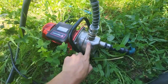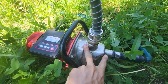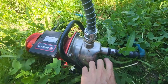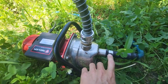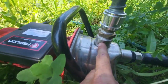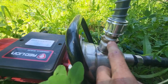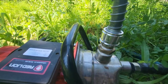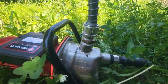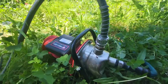This pump comes with both ends as female one-inch standard threads. It does come with a plastic piece that goes from one inch to garden hose thread. I had to buy another adapter — one inch to three-quarter standard thread, and then three-quarter standard to three-quarter garden hose thread. It's just the easiest way to hook up a couple of garden hoses and pump up.